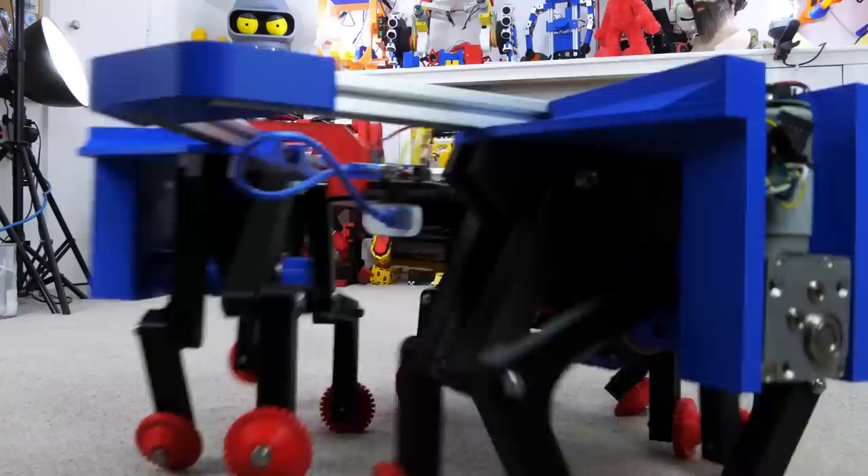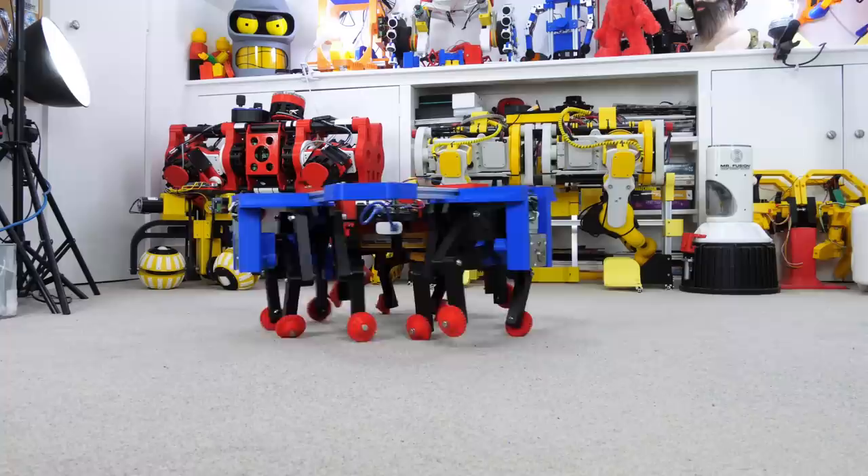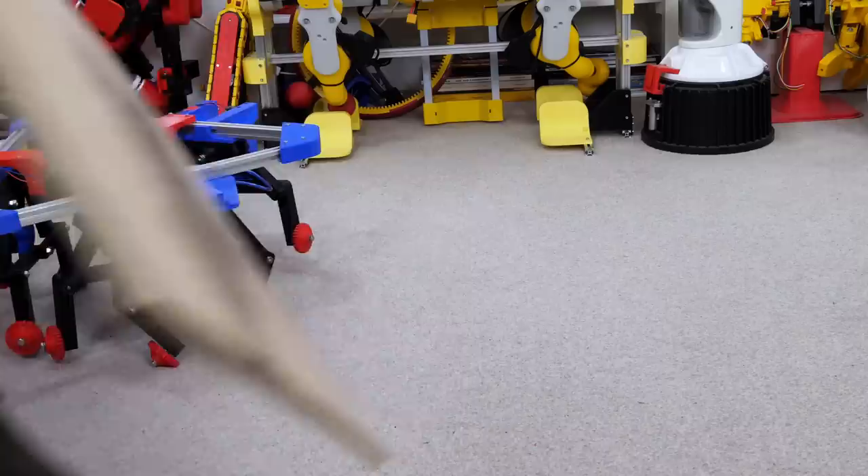I think you could probably add suspension to each of those legs as well so it wouldn't be such a bumpy ride, although the geometry should probably be adjusted so that the legs actually slide along the ground smoothly and they don't go bump bump bump as the distance changes as the feet pick up and down. Alternatively we could add another set of legs, or two legs to each of the drive mechanisms. But for now we can do some multi-terrain testing.